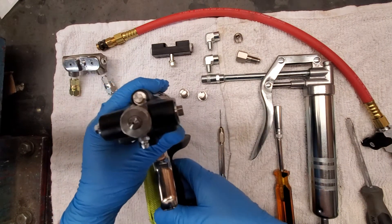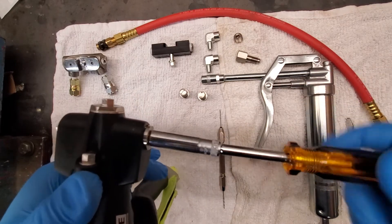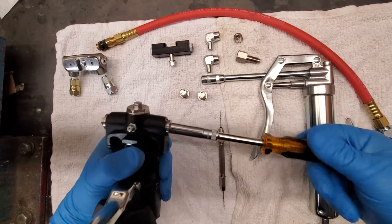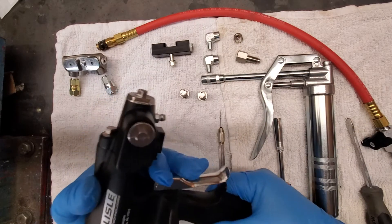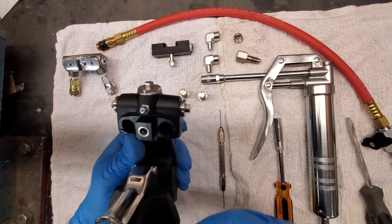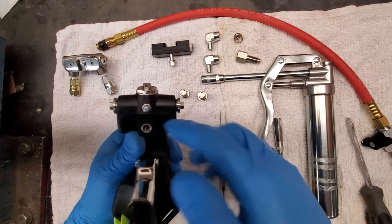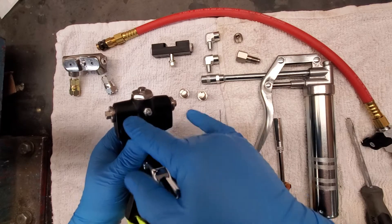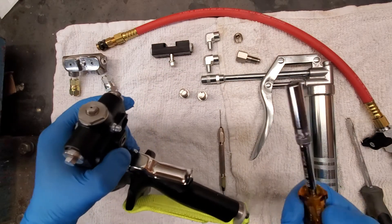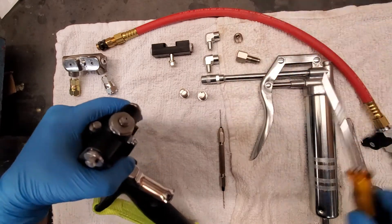You want to be careful not to damage the gun body itself. Next we can remove our side seals. You have a couple of options here: if you only need to remove and clean or check your check valves, you can completely remove them. If you need to remove the front of the gun head, you will need to loosen off your check valves to take the tension off the chamber inside. Also, if you need to change or clean your mix tip, you can do so with your 5/16th nut driver.